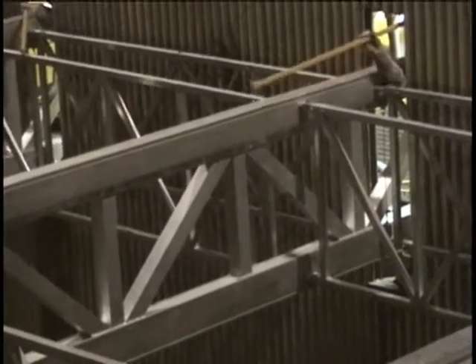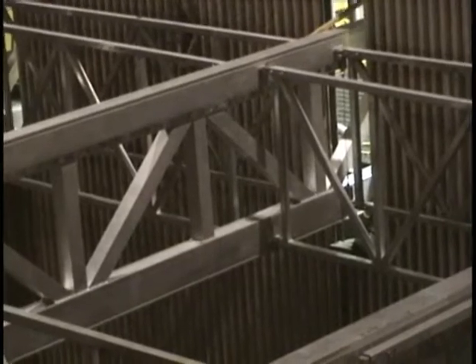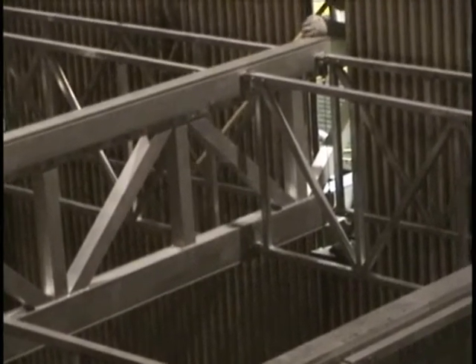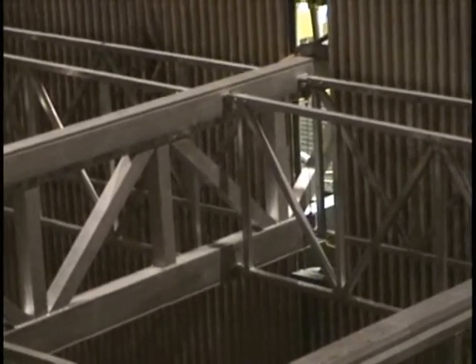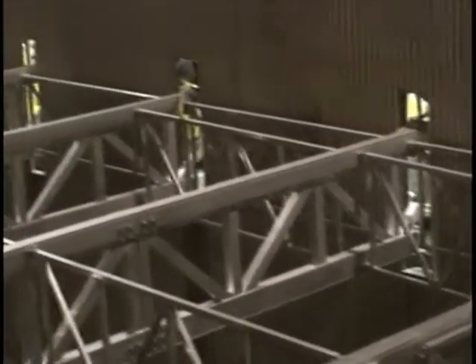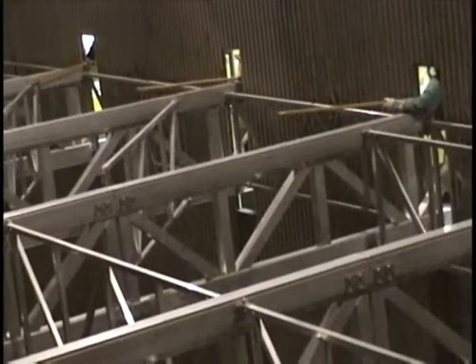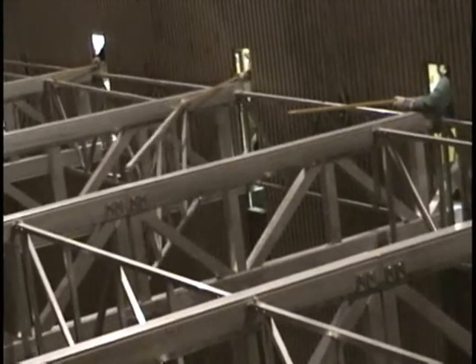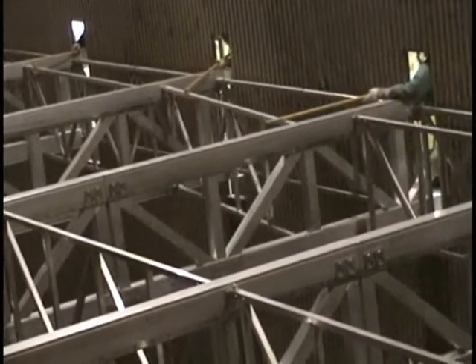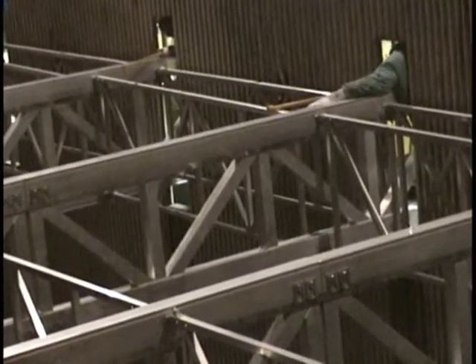Workers on the pinning side will reach in with the bars and catch the rotating cross truss. Then place the T-shaped end on the center of the cable and slowly draw the depressed pins on the cross truss into the upper and lower tabs on the main truss. Workers will finish up this last set of trusses by inspecting the pin locks both top and bottom. A flashlight or additional boiler lights will help.